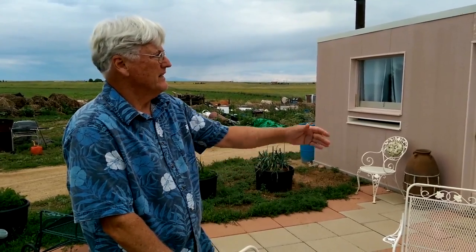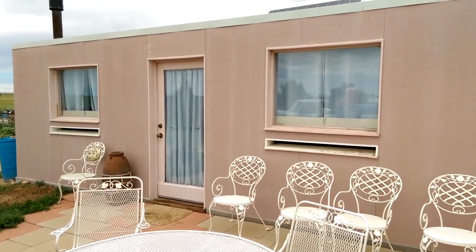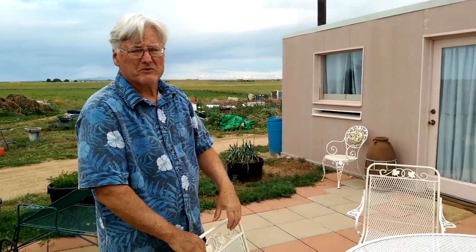Again, we always repurpose and recycle materials. There were a bunch of old 2x4s that I got when I tore down a deck for one of my customers. It was redwood, but it was in terrible condition. Wouldn't be useful for almost anything. So I nailed it together and made 4x4s. And this basically is a pole building. I put a 4x4 about every 4 feet.